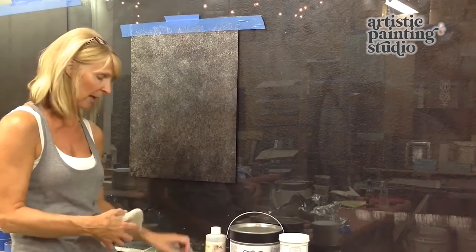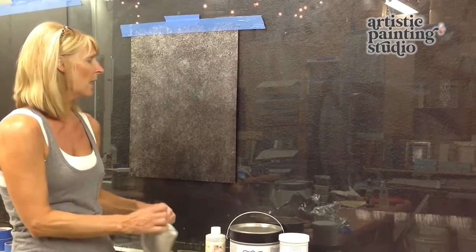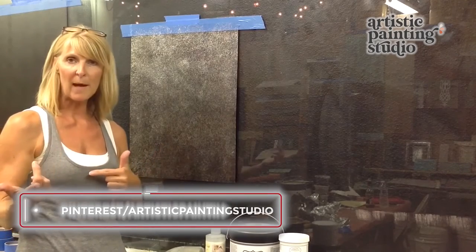This product is applied thin and dries really quickly — within about five to ten minutes that layer is probably dry enough for another coat. One thing to watch for with foils is that they are a very high-shiny, reflective surface. To keep that surface, you want to top coat with nothing less than satin — most of the time I'm in a semi-gloss or gloss top coat. If you want to knock it down a little bit, bring the sheen of your top coat or glaze down so you can soften the reflectiveness.